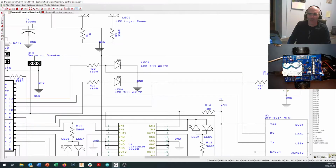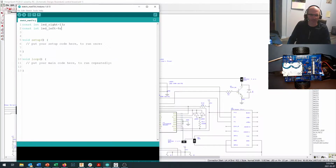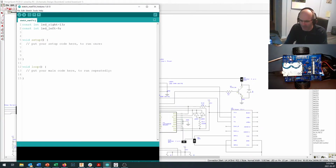Alrighty, so let's bring up some Arduino code and see if we can get the LEDs to turn on and off to test something on our robot. So here we go. We've come in, we've defined them. Constant LED right is 13, LED left is 9. So in our setup code, if we want those to run as outputs, we need pinMode, spell it right. You'll notice it changes color when you spell it right. pinMode(LED_right, OUTPUT), and pinMode(LED_left,